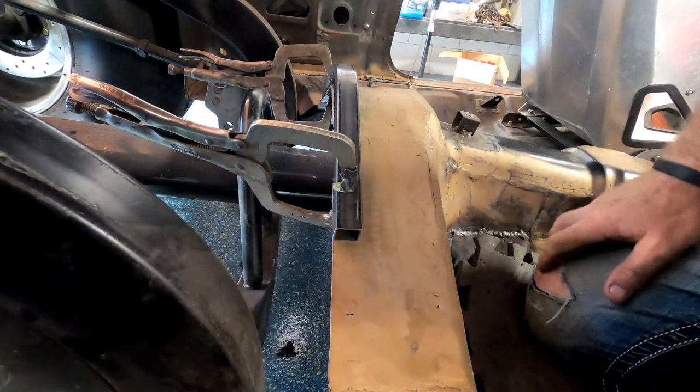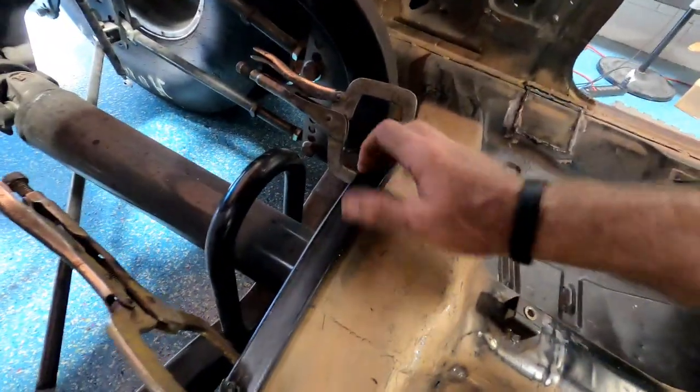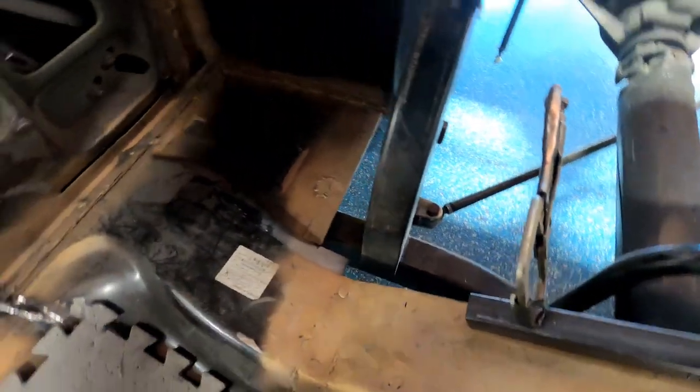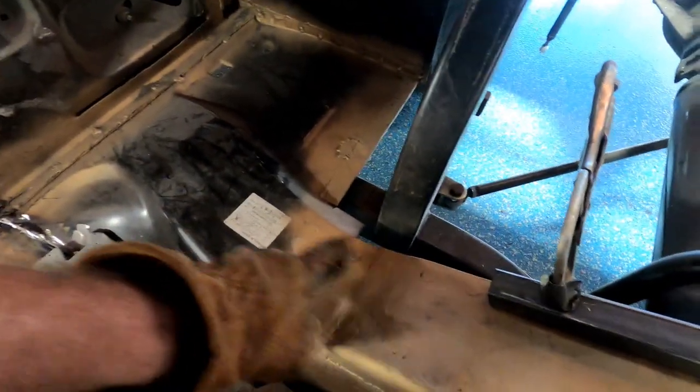But anyhow, so I need to do my measurements from here to here. Make sure where that is. But now, I'm going to do this in three pieces because trying to do one piece, get the length right and make it fit in here, because of the curves things shrink up some. So I'm doing a bunch of welding already, so what's two more places. So I'll get the length of this, get a rough idea, I'll overcut it so then I can trim it and make it fit. But we've got this little bend to do.